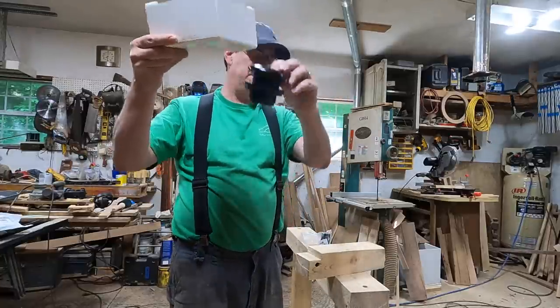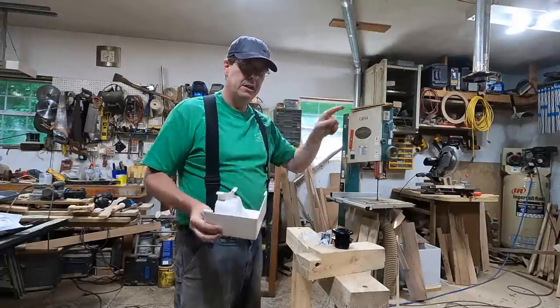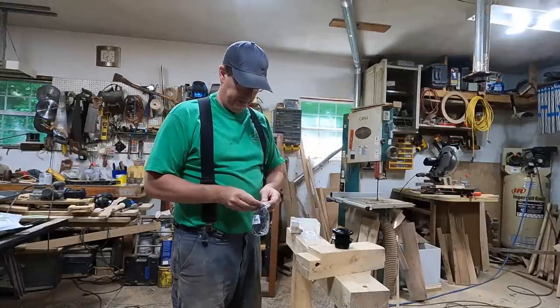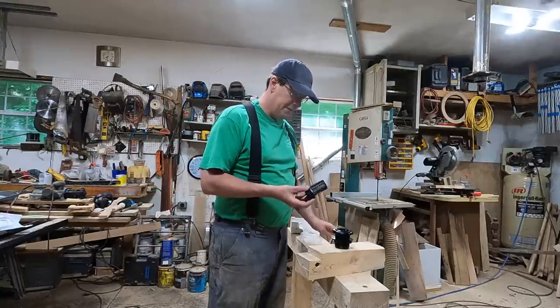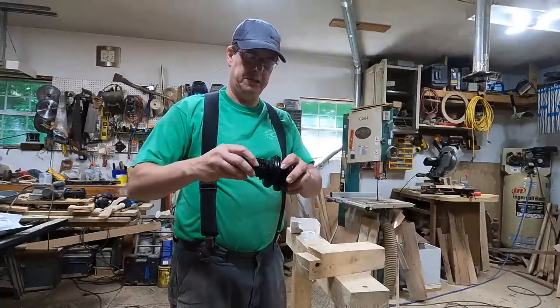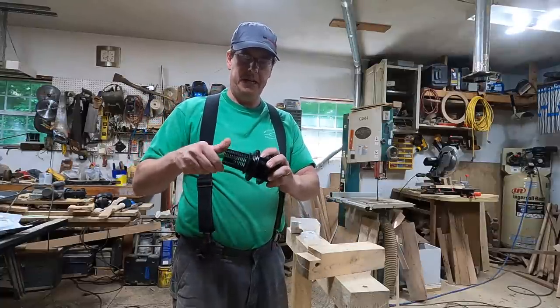And of course, a drain below it and a piece of 1.5-inch PVC will go into there, and we'll angle it over to our barrel that we're going to fill up. And obviously, to keep the leaves and all the detritus and all that fun stuff from getting down in my barrel and clogging everything up, you can order this little drain screen. It just screws into the top of the bulkhead, like so.